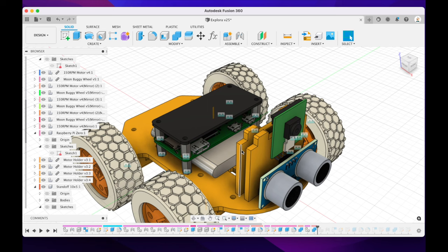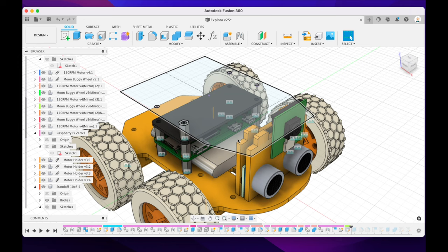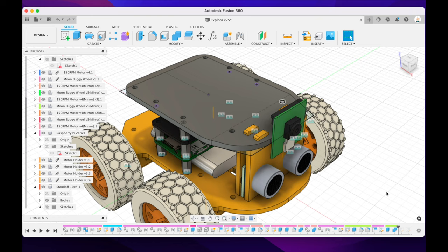I replicated that same camera holder — one at the front and one at the back — though I later discovered it's not wide enough. I then replicated the standoffs one more time to build a new top base plate that sits between the lugs and the standoffs. I do a bit of finessing, rounding out some corners, and use the camera plate as a cutting tool into the top plate — keeping the tool — to create holes for the standoffs and the lidar mounting holes. When I actually put the lidar in place on the model, it clashes with where the camera is — I've had to put it back to front. I'll need to turn the design around for those mounting holes on the next iteration. This is what I mean about having to keep iterating through your design.